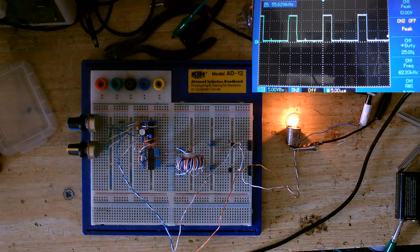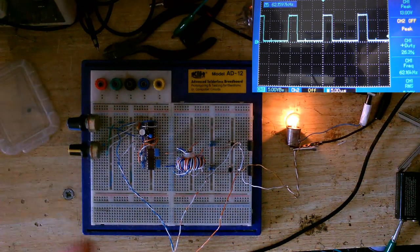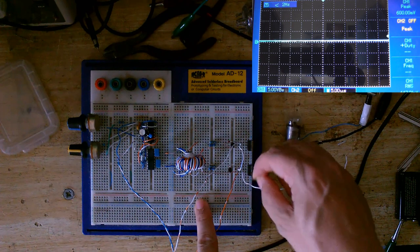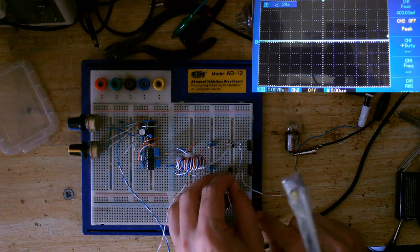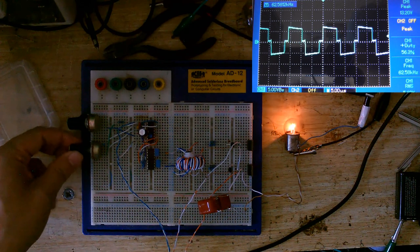I'm going to do a little experiment — I'm going to connect a light bulb here and there, and then put a capacitor between the light bulb and the output. I've also got the scope connected across the light bulb. Turning it on — that's looking good, nice 12-volt peaks across the light bulb. Let's adjust the duty cycle — yep, looking good. I've got a couple of 1-microfarad capacitors together so about 2 microfarads. Connecting that capacitor across — we seem to have lost a little bit of voltage but it's working.